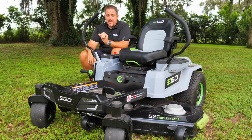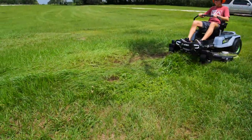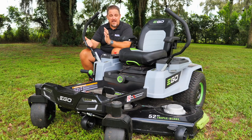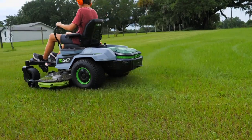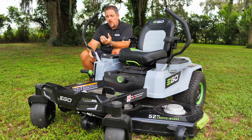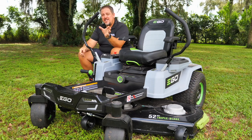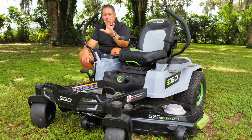This thing is very easy to operate. I mentioned the three different modes — I would definitely recommend not starting in sport mode. Even though I've been using a zero-turn for 15 years, sport mode on this thing is really too aggressive on the turns and you'll start ruining the turf. Definitely stay in standard or control mode to get a more softened approach when making your turns, especially on 180s. As far as the controls, they've done a really good job at making them feel like a zero-turn. Also, don't make the mistake I did — I had the sticks on the insides; a viewer on Instagram pointed it out, so I put them on the outside like they're supposed to be, and now they operate absolutely fine.